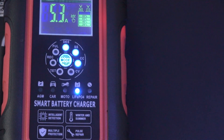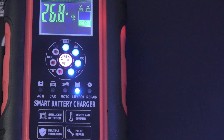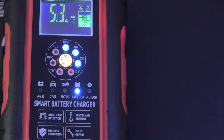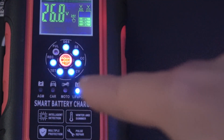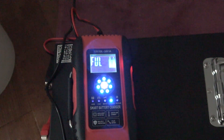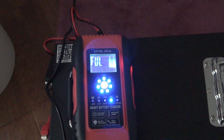After about five hours it hadn't changed, but now we've bumped up to 26.8 volts — still pumping 5.3 amps but the voltage is starting to climb, which means we're getting on the curve. I ended up leaving it running all night and at some point the battery filled up.